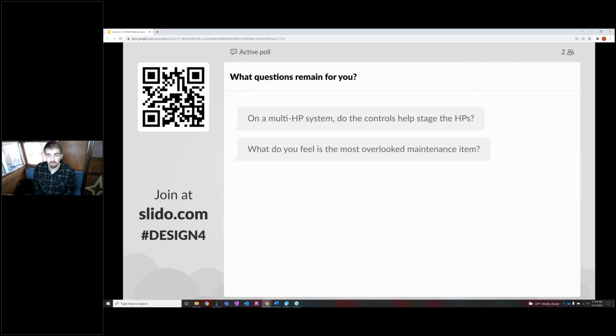follow that blindly. So in our case study today with Elizabeth James, the heat pumps are actually controlling themselves, and each heat pump has its own control logic, and the temperature maintenance has its own control logic based off the electric resistance heater and the sensor in that tank. But then the Jackson, the site we talked about last week, has a totally external controls platform that looks at all the system temperatures and then tells the heat pumps and the backup heating when to run based off its own internal logic.